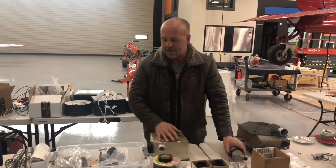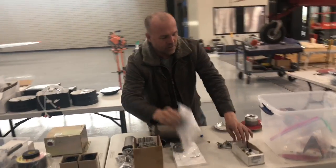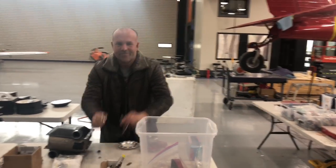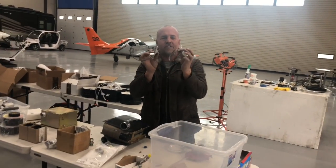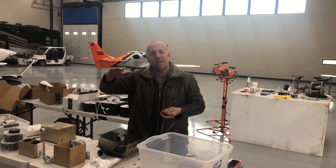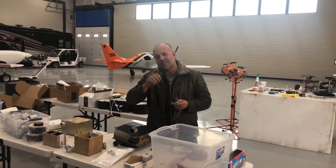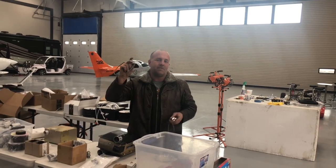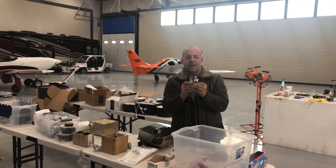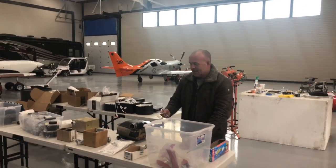My relay box is finished. These are all the heating components. I've got a bunch of lighting, fuel probes, a transducer, dual pressure regulator, and a transducer for my torque. These are cool - these are actually ultrasonic fuel sending units. They just tell me if my fuel is low. I'm gonna put these to let me know when my wings are empty and the fuel coming down the line to the gear leg will send a light on my dash saying the right or left wing is completely empty - warning indicators before the fuel gauges on the gear legs even start to drop.